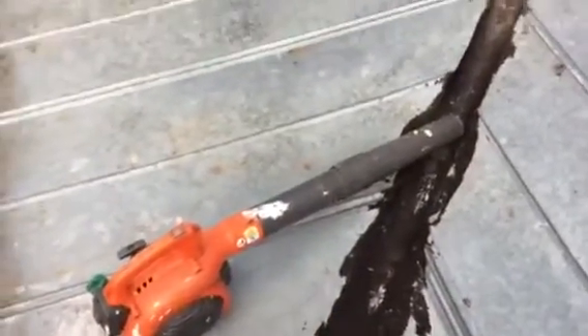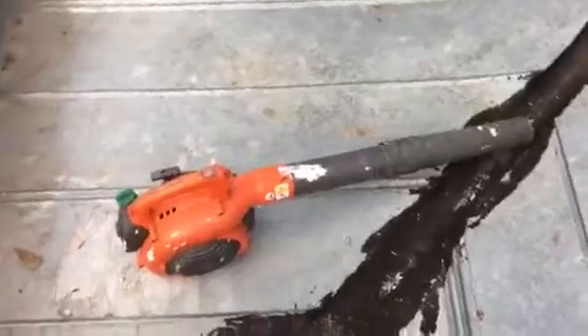We can go all the way back up here to where the most recent stuff was used. What I want to do is get material to remove all this old existing stuff, get down to a good clean surface, and seal these 5V crimp panels down to this valley metal. There's a big crack right there. Essentially, make this whole thing solid from panel to panel — almost like there wasn't even a valley there — just one solid piece. This will eliminate any future problems.